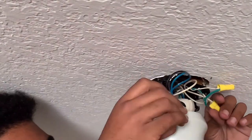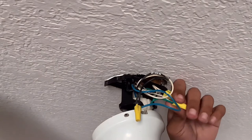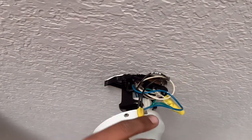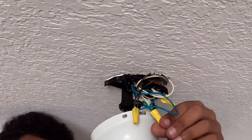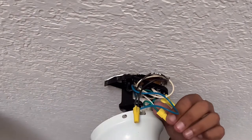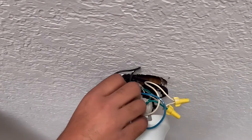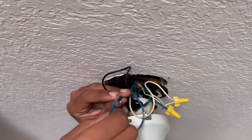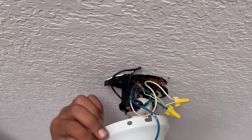You'll have your three wires as you take it out to the ceiling fan electrical mounting plate. You'll have your black wire connected to blue — this goes to the motor of the ceiling fan. The green wire is the ground. If you're wondering why the white wire appears discolored, it's probably because paint got into the copper of the ground and covered it over — I don't recommend doing that to your ground. The black wire is the hot wire.